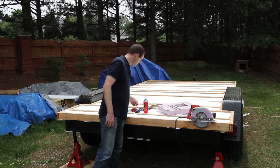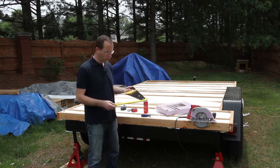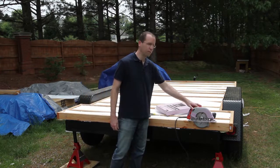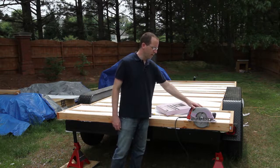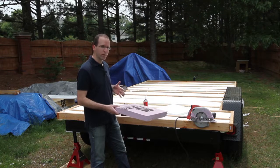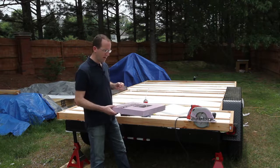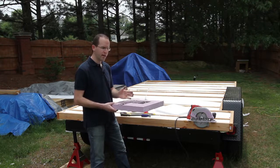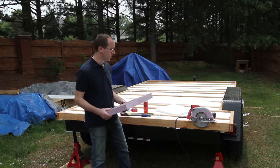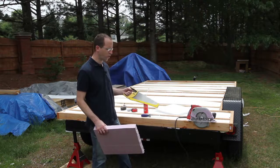To cut the foam panels, you can use a couple of different tools. This is a drywall cutter, which works well on small pieces. I also have a wood saw that cuts well because it has big teeth. What works best is a circular saw — it's great especially when cutting through multiple pieces, making the job easy. The only issue is the blade gets very hot and since the foam is so soft, you may inadvertently turn the saw as you push, causing it to melt the insulation and cut at an angle, making the piece a little smaller than intended. Still worth it for the speed compared to using a hand saw for each piece.